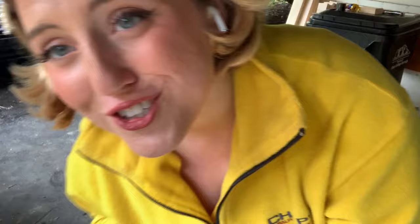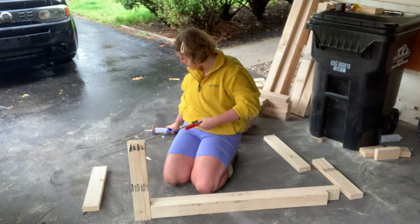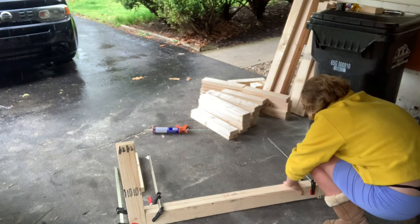The gluing process was kind of difficult and I made some mistakes. I didn't spread out the glue at first — I recommend using a thinner layer because I used way too much and wasted it. I also didn't pay enough attention to measurements and angles. I really should have been making sure everything was a right angle, especially making sure that the lengths of wood matched up at the ends of the feet.